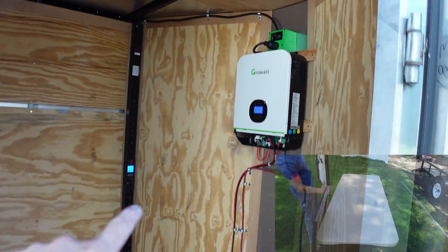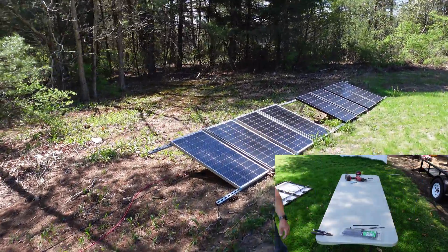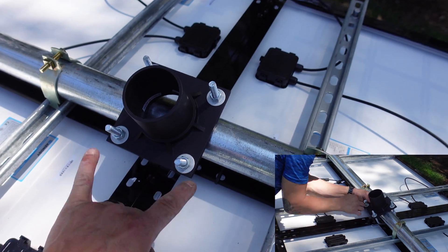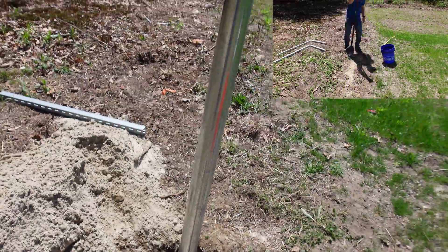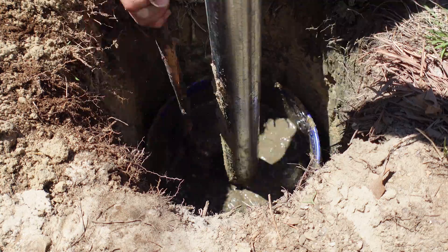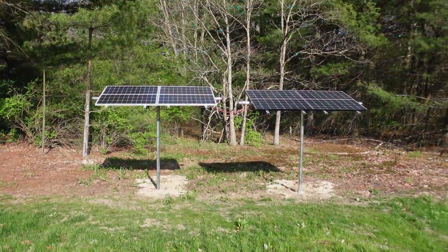Now that this is all up and running — this is solely off-grid, solar panels have been in the sun since 8 this morning — I'm going to be redesigning the panel mount. Here's how you build it: four pieces of unistrut across and one galvanized fence post straight across the middle with a circle-to-square adapter and a couple U-bolts to hold it together. I went and dug a post hole — the cement is pretty much dry, the pole is nice and straight. I drilled holes in the bottom of the bucket to allow excess water to filter through the concrete.